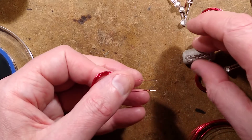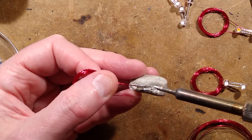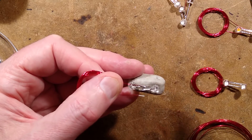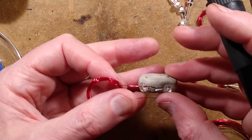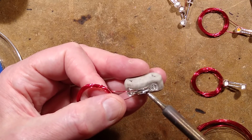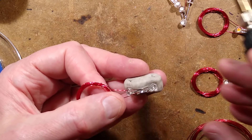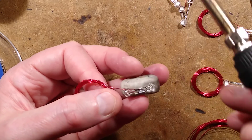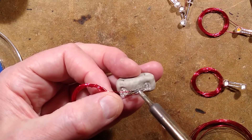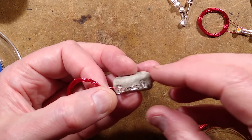Now I've bared that, I'm going to solder it to the LEDs — first this side, just reflowing the solder briefly. Then let it cool so it doesn't move. If you went straight over to the other side, it would potentially desolder the LEDs from each other completely when you remelted the solder. That's the second side done. Let the solder cool and set and harden without blowing on it.